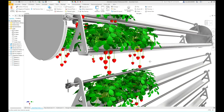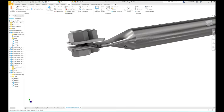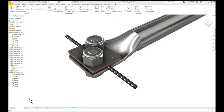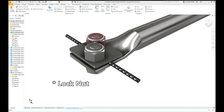Here's a rough design just so I could lay everything out and figure out my spacing. It's definitely not complete — I didn't draw the bottom wheel or the left side, and didn't put all the strawberry plants in, mainly because it takes forever to render everything once I get that many leaves in there. But it gives a good idea of what I'm attempting to do. We have a bunch of plants sitting in the gutter, the tray is hanging on a bar that goes all the way across, and the bars are all interconnected with cables. They ride in the track on each of these bull wheels and are pulled along in slots. Here's the end of the hanger rod, which is a piece of half-inch conduit that I'll crimp down into a flat piece, and then that will have two bolts going through it with a washer plate — or crimping plate — that will crimp the cable onto the conduit.